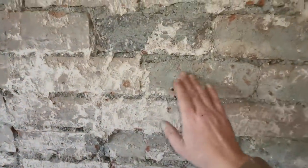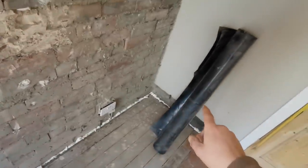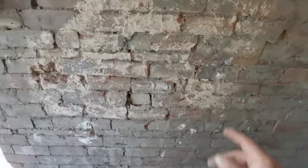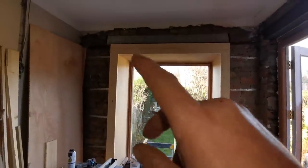I'm panelling in here. I took the plaster off because some of it was a bit loose, but it's very dry — I'm not worried about damp. I'm going to put a damp course behind the batten, then my panelling's going on with some insulation behind it. I've got a build-out behind there, and then plaster is going to tidy up on top and sort the ceiling out.